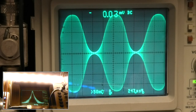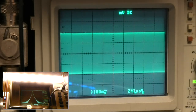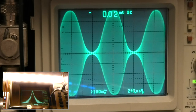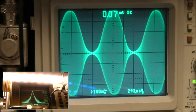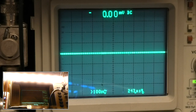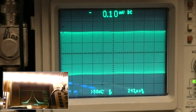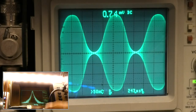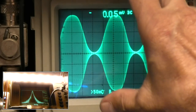The wave looks overdriven. It's right at its edge. And it's not reaching the same positive peaks. Let's go back. See the difference? Does a calibrated scope matter? Yes. Let's go back here again. And remember, this would be like one bar up and one bar down. The top and the bottom, the positive and negative peaks, are not in relation to what you see on the spectrum analyzer. It would be wider and be spread out. The amplitude is not the same.